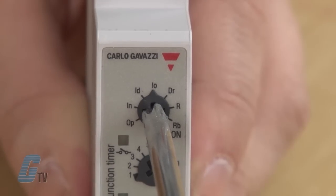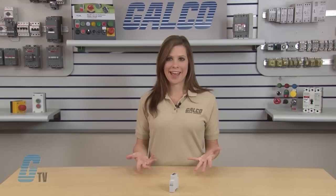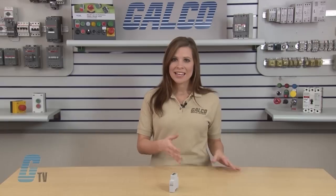I-O stands for interval on trigger open. The relay operates and the time period begins as soon as the trigger contact is opened. At the end of the set delay or when the power supply is disconnected, the relay releases. The relay operates once again when the trigger contact is opened again. If the trigger contact is opened before the end of the delay time, the relay keeps on and a new time period begins.